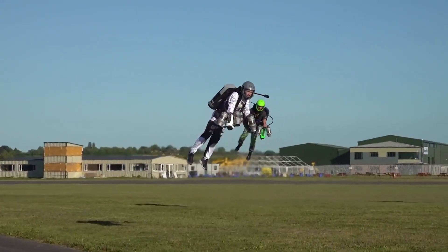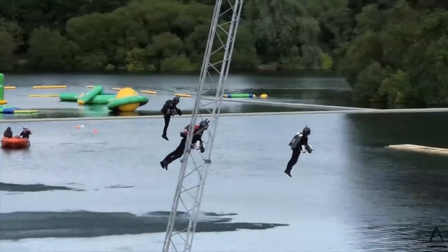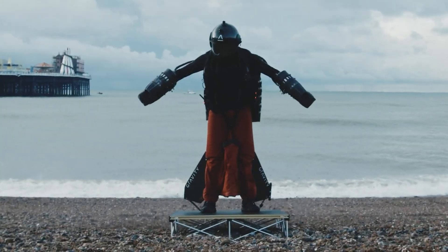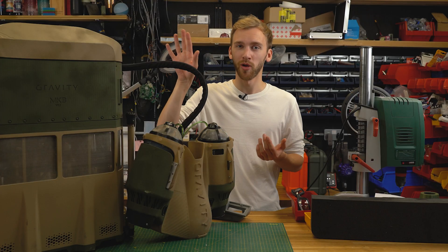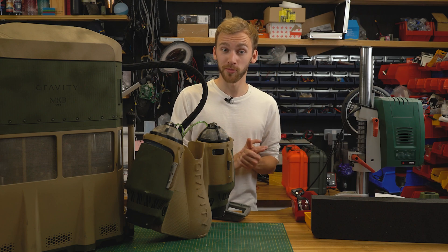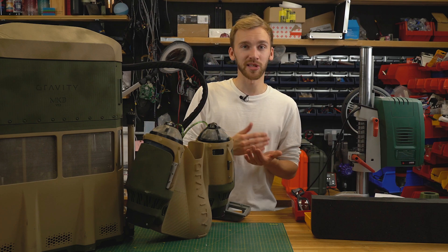Since landing on the tripod design, the main changes have been increasing the thrust-to-weight ratio in the engines and the productization factor — turning it into something really easy to use. That can be as simple as how long it takes to start: the old suit took about a minute and a half to start up, with little flames slowly building up. That slow spool-up sounds brilliant if you're making a movie, but for real-world use — flying off a ship or flying up a mountain to help someone in medical peril — you don't want a cinematic startup. The new engines start up in about 15 seconds.